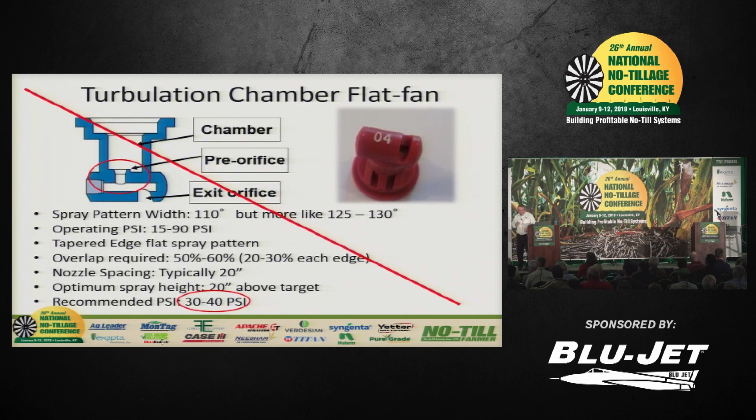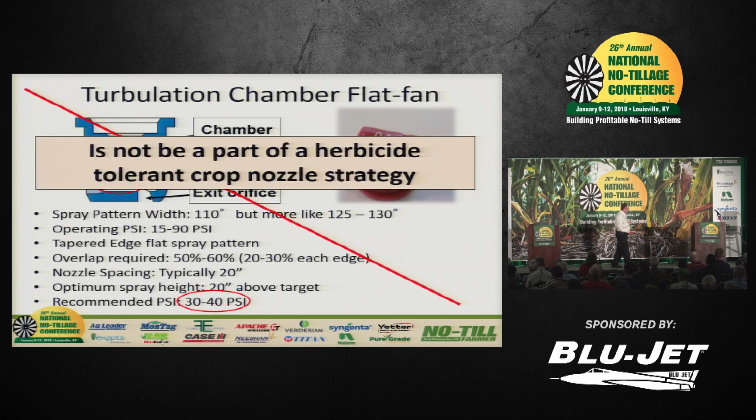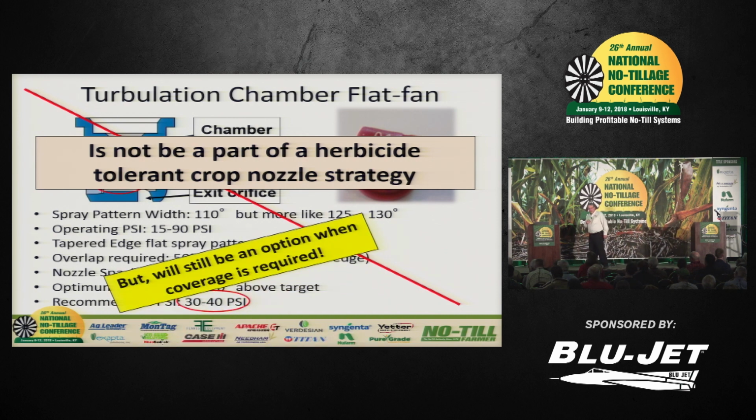Okay, a line is drawn through here, which means that it doesn't fit all purposes anymore either. It will not be a herbicide-tolerant nozzle just because it has the higher drift potential, but not as high as the XR. But if you're applying anything in your program that requires coverage, like glufosinate, any kind of fungicide, any kind of insecticide, Gramoxone, those require coverage to work. This nozzle works well for that purpose. This nozzle works well, and I've said that for years, and it's still there, still prominent.